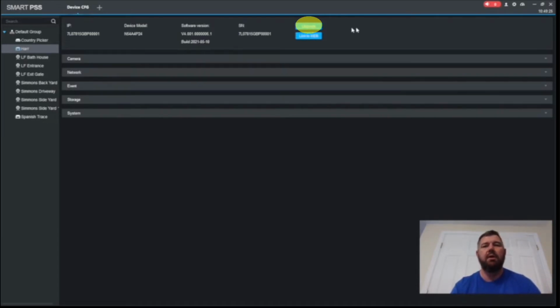What we're going to do is get our device model number and our firmware version. You can see this is version 4.001. And we're going to head to the Dahua Wiki firmware upgrade page. We're going to put in our model number and we'll be able to find the upgraded firmware. I happen to know this version 4 is now at 002, so that's what we'll be looking for. And again, our model number is N54A4P24. So we'll head over to the Dahua website. There is a link to this particular website in the description to our video.